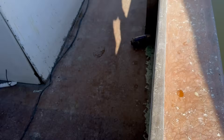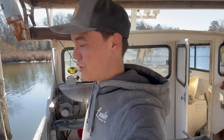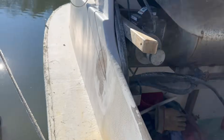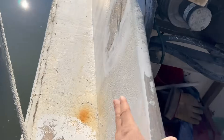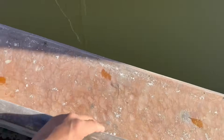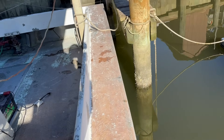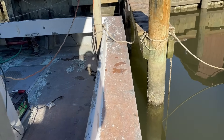We're doing the collarboards here too. There's different terminology for these parts of boats depending on where you're at and who built them. On a work boat, we usually call this slanted piece that comes down off the back of the cabin the collarboard. And then at some point they just start to call it the washboard, and it goes around like a perimeter. This here is what they call a gunwale — they make them wide on work boats so you have a little bit of walking space.